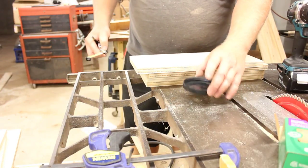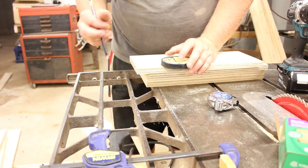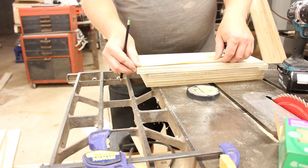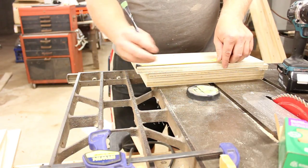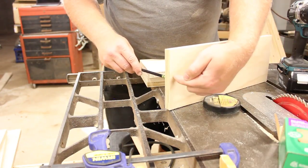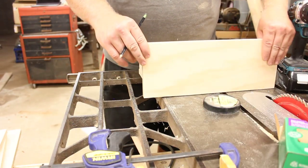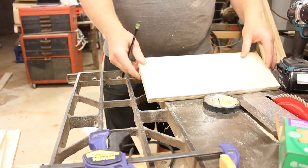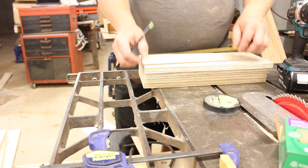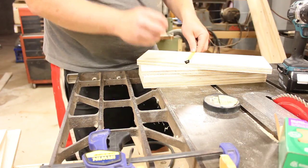This biscuit cap will do — it's a little over three-and-a-half inches. So I want the legs to be about four inches by four inches. This is the longer bit; the ends are going to screw on here with the screws going through there. So I'm going to make a template and then cut it out, sand it, and use it to trace the rest of them.